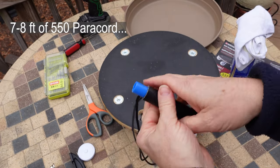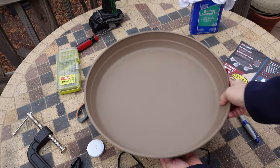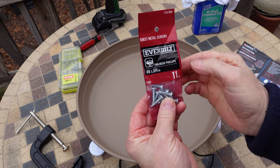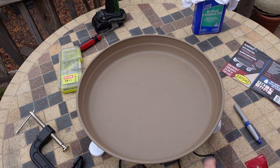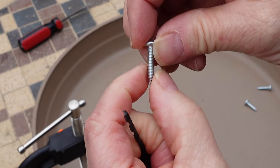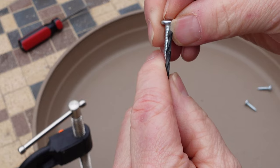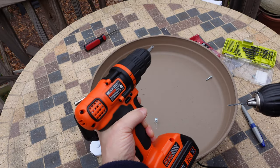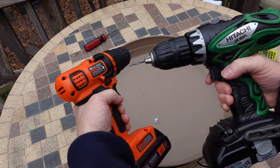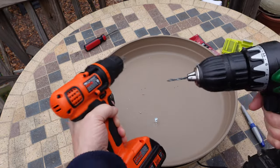I'll post up the dimensions of this lanyard. The next thing I'm going to do is drill some holes to keep the tray from moving around, using number eight pan head Phillips screws, three-quarter inch. I always take a drill bit that's slightly smaller so you get some grip on the screw, but it makes it easy to put the screw in without shredding or breaking the wood. I have a screwing drill and a regular drill bit drill — drill, screw, drill, screw — makes it a lot faster.